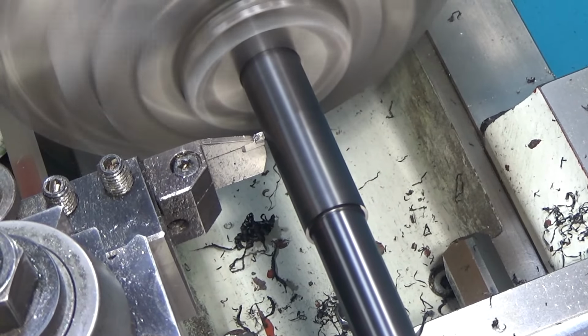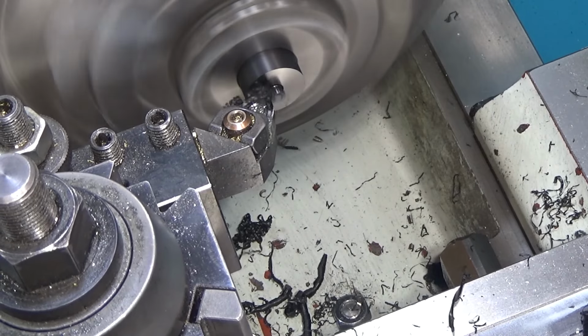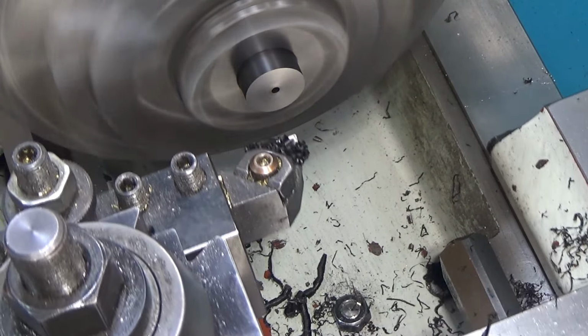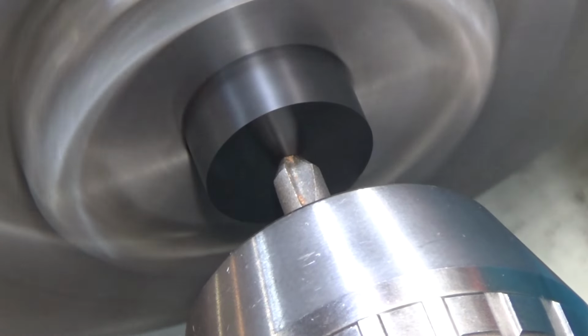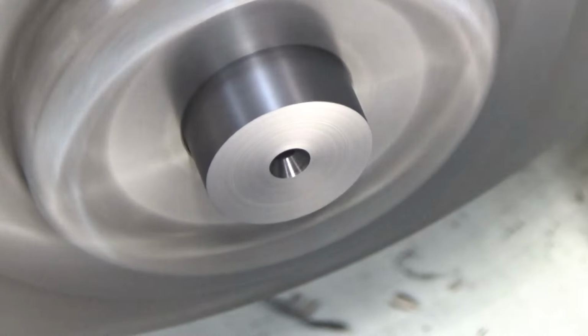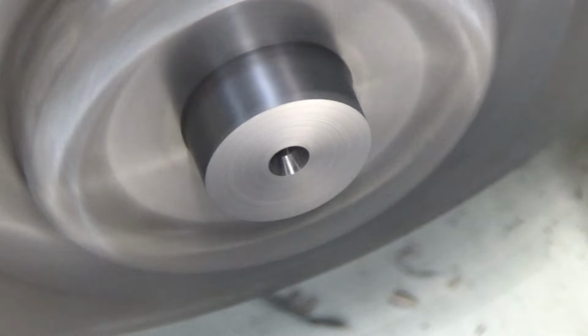It's good the hole went past this point. I can turn this around and we can put the flare in so that when the needles get pushed in, they won't run into a lip or anything. I'm going to use a 60 degree chamfer bit. That'll give a generous lead-in. And I think we're done.